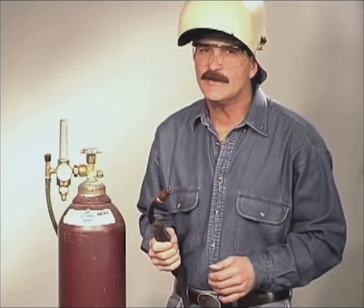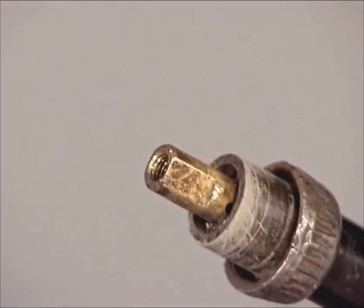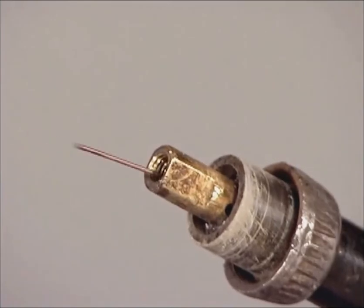When you are installing a new roll of wire, after it is inserted into the liner and the drive rolls are closed, lower the hood, turn the machine on, and straighten the lead up a little. Then pull the trigger. There is a very close tolerance between the wire diameter and the opening in the contact tip. It is a good idea to have the nozzle and the tip removed until the wire is all the way through.